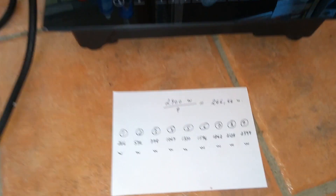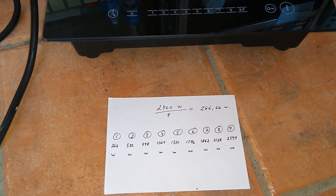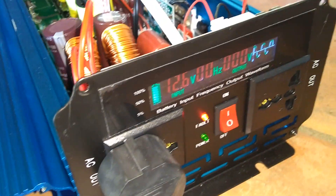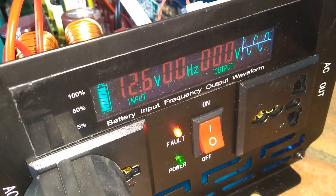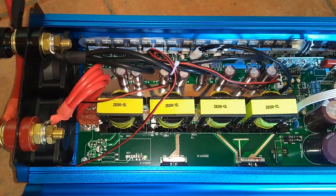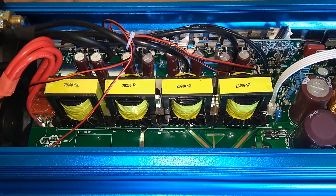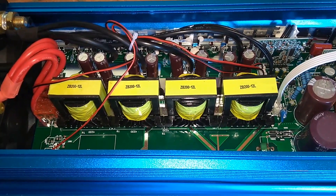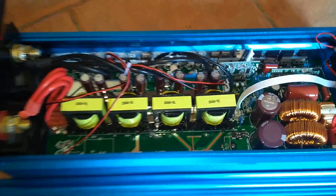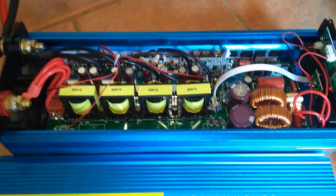I just want to see approximately if it can handle this induction plate, because I'm going to use it for that. I can show you the inverter here — we have power, 12.6 volts. Inside this inverter you can see it looks well built, but I don't like what I see here. It's only 4 transformers — I think they're 500 watts each. And in the 1,000 watt one I only got 2. So I believe this big one is actually not a 2,500 watt inverter — I think it's more like a 2,000 watt inverter. But I'm gonna test it.